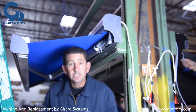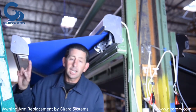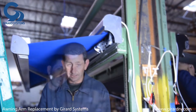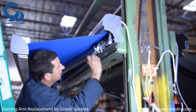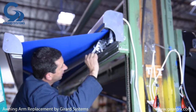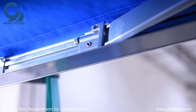Now that we've taken the tension off the arm by cutting the stainless steel cable and the lead rail is supported, we can undo our hardware using the 19 millimeter and the 17 millimeter tools. With your 19, back off the 19 millimeter nut and bolt completely until the pivot of the arm releases itself. The hardware will remain intact in the shoulder.